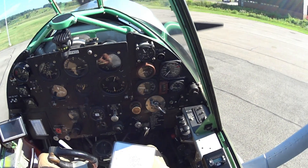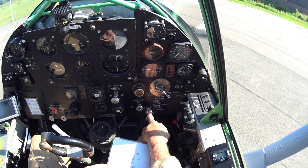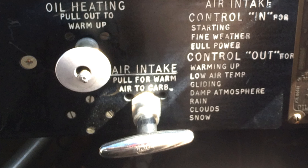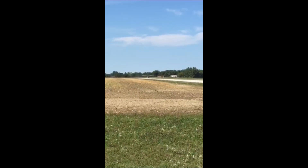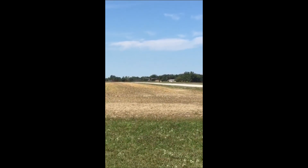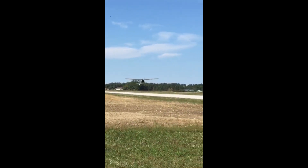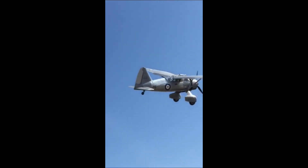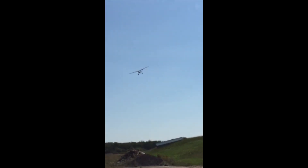Another very significant factor with operating a Bristol Mercury engine is carburetor heat. It's very susceptible to carb ice and quitting. The Bristol Mercury engine manual recommends carb heat hot anytime the outside air temperature is below 15 Celsius, which is very unusual. Well, that's pretty much it — the rest of the cockpit controls and indicators are fairly standard or intuitive. Flying the thing is not. For more information about that, please see my other videos.